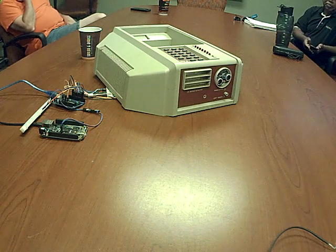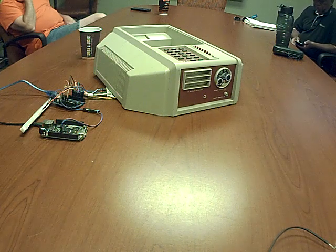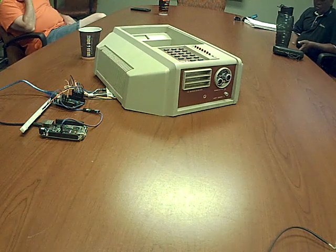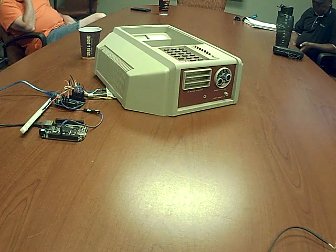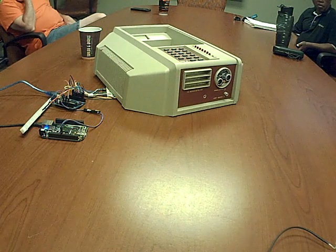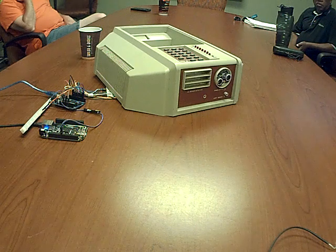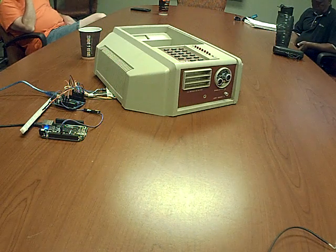And more. With the Arduino, you've got one loop, right? You can make function calls, but it's going to loop through everything every single time. So if you've got five sensors, they're all going to get queried linearly over and over. When you're running a program on the BeagleBone with five sensors, is that five separate programs? Is it one program checking all five sensors? Is it one program calling other programs? It depends on how you wrote it. You can do it any way. It's much more flexible.